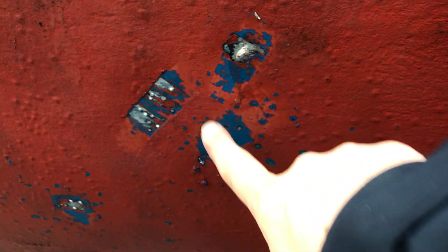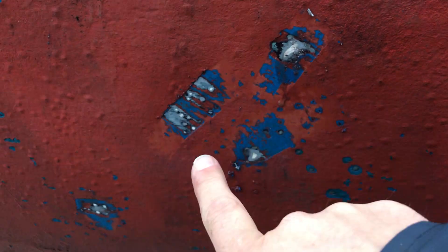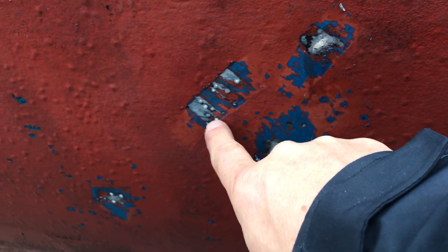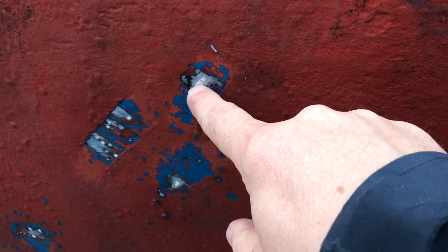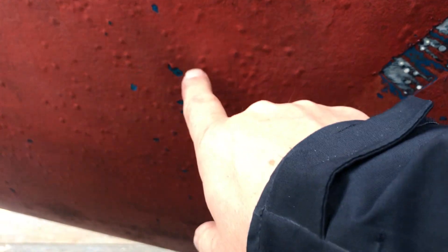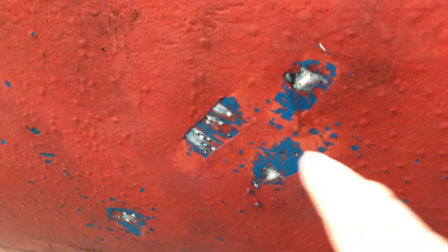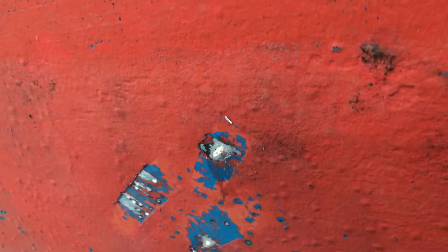Let's have a look at this area where a surveyor has scraped away the anti-foul and revealed the layers underneath. You can see a red layer of anti-foul, a blue layer of anti-foul, a grey layer, and then he's scraped through to the tops of the blisters which are white — that's the nice white outer layer — and these are the raised bumps of the osmotic blisters. This slightly larger blister here he's pierced with his tool, and some liquid came out. When that liquid is osmotic, it smells really vinegary — which it did — so that's a dead giveaway. That's what osmosis looks like.